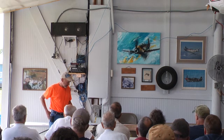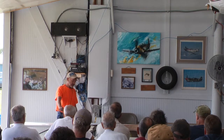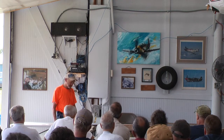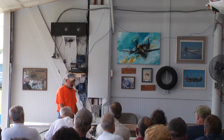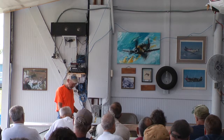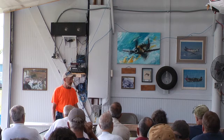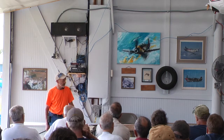So the day I was ready to glue it up, I mixed up the first batch of glue, smeared it on with a notch trowel, and laid it up, making sure that I alternated the heavy ends. I had 5 laminations 3/4 inch thick, and then when I had all the laminations glued together, smeared and laid up, then I drove the dowel rod through each end of that block so that it wouldn't move. And then I proceeded to clamp down with the C-clamp pressure all the way around.